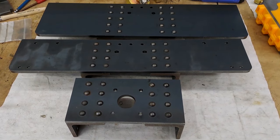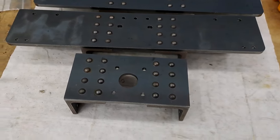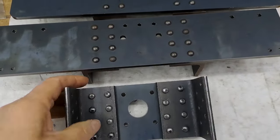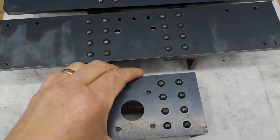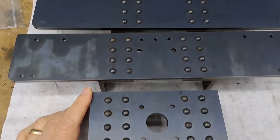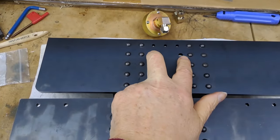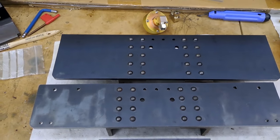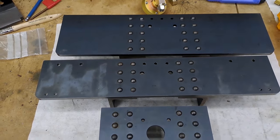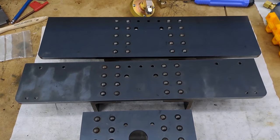Right guys, back again. So there we go — that's all the rivets in, 52 of them. Only took just under two hours to put them in, no great sweat or effort involved with the rivet press — it's very efficient. As you can see, they look really pretty, they've come up really nice. These are the manufactured heads of course, and that's the rivet press heads. You're given a choice of two — either a good side or a less good side — so you always put the good side on the outside. Right, a few things to do before I test-run putting the frames together. These four holes need to be tapped — I believe they're M6 — and those two also need to be tapped, I believe they're M8. I'll check that on the drawings and get back to you once I've got that done and the frames are put together.